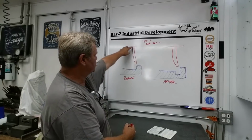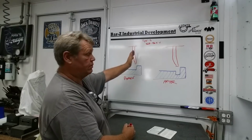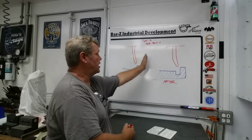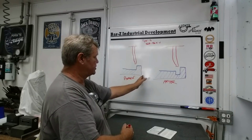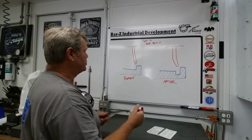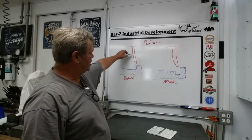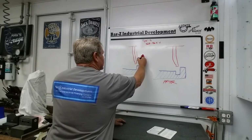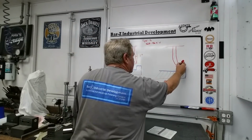First thing we do is we take the Type 13 wheel, which is dished, and actually I put it on backwards on my machine. So this is the operator side out here, and this is the spindle side or the tower side in here. And I can put my work down on the mag, put it up against a fence, so I've got an index surface and make sure I'm running parallel. Before I put my work down, I'm gonna come in here with a tangent dresser, and I'm gonna cut this back. I only cut this back 1 degree. This is exaggerated here, but this angle right here is 1 degree.